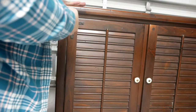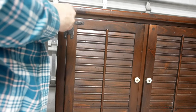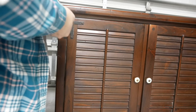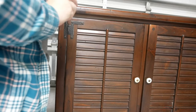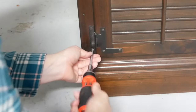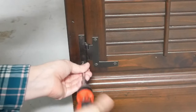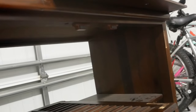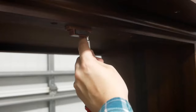The cabinet hinges are these really neat-looking L-shaped brackets. As I'm taking them off, I'm making sure that I put them in a specific order so I don't have possible issues putting them back into the doors. With older furniture, metal hinges can warp over time, and it's much easier if they're put back in their original location. With the metal clasps, I remove them and attach their smaller screws to their respective magnets. I used my Milwaukee ratcheting multi-tool to remove all the screws — I stay away from using a drill so I don't potentially strip out the screws.